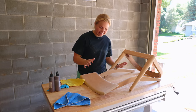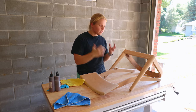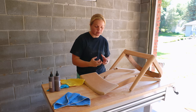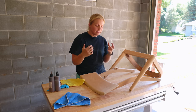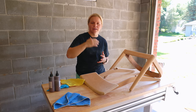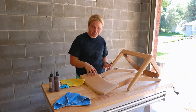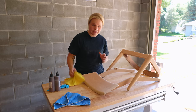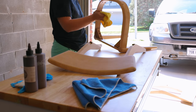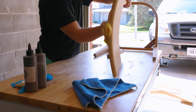Now that everything is sanded — I did start with an 80-grit but then worked my way up to 120-grit and then up to 220. You want to do that to reduce any swirl marks that you may get in your wood, because the 80-grit is super coarse and sometimes you may get some swirls, but you need that coarse grit to get the stain off. That's why it's important to smooth everything out and work your way up to finer grits. Now I need to wipe back the dust created from all of that sanding and make sure all parts and pieces are nice and clean before I put the stain on.